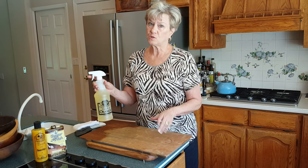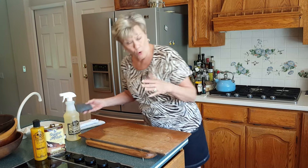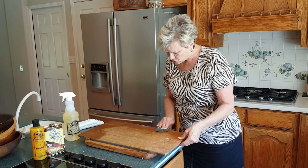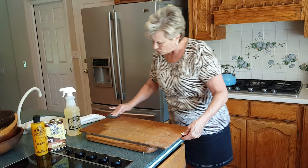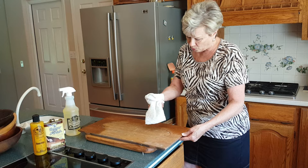This would be three steps. Number one, we're going to clean. Go ahead and spray that cabinet down or that table. You might have white water rings. Maybe you put a pizza box on the table. Take a little 4-0 steel wool and just go with the grain. Let's clean that up really good. Use terry cloth to wipe off any excess dirt or oil.